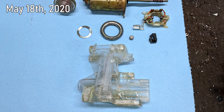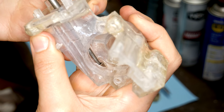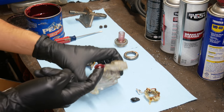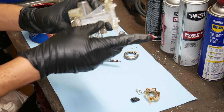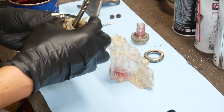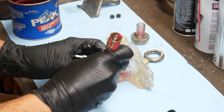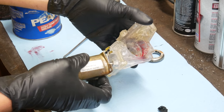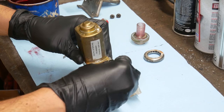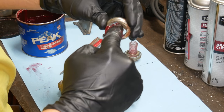Three weeks and three layers of slathered-on epoxy later, we finally got back to putting this gearbox back together. The first thing we need to do is get the motor shaft bushing pressed back into place - we were able to do this easily by using an awl to apply just a little bit of force. Now things are about to get messy because out comes the grease - we're using a generic wheel bearing grease, which is probably thicker than what it came with but should work fine. We'll goop up all the surfaces that are going to have moving parts on them, starting with that shaft bushing. To get the motor ready to reinstall we need to reunite it with the brush assembly and get the brushes back into place on the commutator - with everything open this is very easy, just using a flathead screwdriver to compress the brush springs and slide that back into the motor housing.